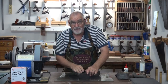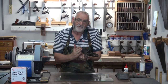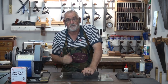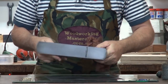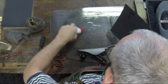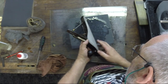Now I'll do the cheeks and I'm going to try and keep this at 90 degrees. Not that I intend to use this as a shooting plane, but if you're using a shooting board and you're going to use this plane on it, you've obviously got to have 90 degrees or else you're not going to get a nice clean shoot. Your timber is going to be a little bit off if it's not a true 90 degrees. Now quite frankly, that's looking pretty good. I might just put another sheet of 120 on there and give it a final lick before we move up the grits, but I'm pretty happy with that.